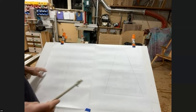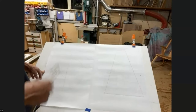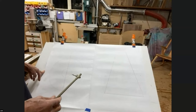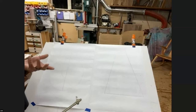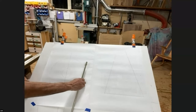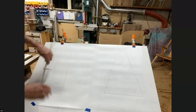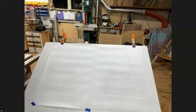It is a lot easier to cooper things if you're trying to have all the parts be the same. With the spiral, we'll talk about how it'll be different. But if you pick an even number of pieces to divide it into — for this one, I'm going to set it up so that it's 12 pieces. You can pick any point along the edge. As you know, the radius — there are six of those, right? You all remember math. So three gets you right to there. I can keep going around and make six, which would divide it into six parts.